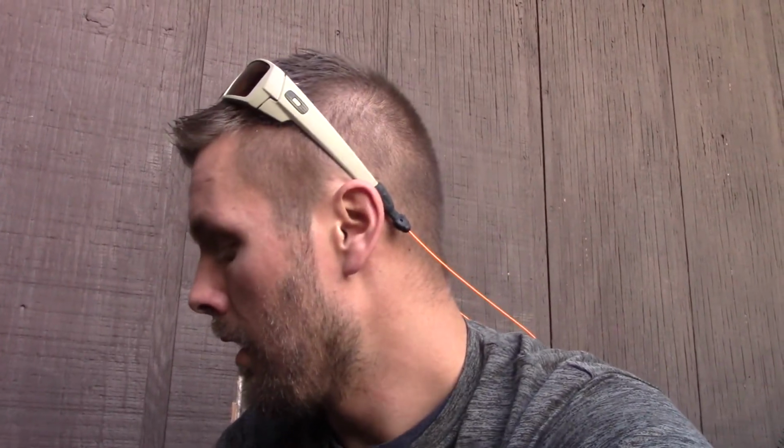But anyways, I just wanted to show you that. If you're going to cut a pressure regulator out, it's probably a good idea to check and make sure that you're not going to have an issue, and just put a gauge on one of your shutoffs or one of your supplies in your house just to make sure you're not getting some kind of excessive pressure.